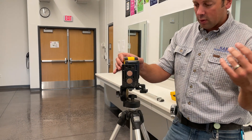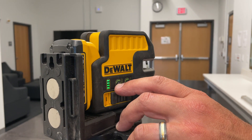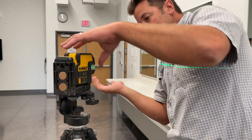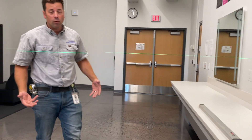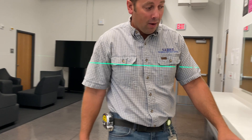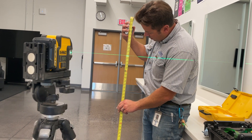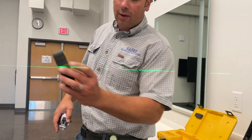At this point, when I'm relatively leveled in, I can turn this on. I've got a full battery. I've got two options: I can throw a constant horizontal line, I can throw a set of dots, or I can do both. We're going to go constant horizontal line — that's going to give me my elevation line. This is just a flat-with-the-world laser line. Because we're indoors, we can get a visible line around the entire room. Outdoors, unfortunately, this is only visible for about 15 to 30 feet depending on if it's a bright sunny day. If you do this at night, it's awesome — you don't need the remote locator; you can just do it with a tape measure. My magic number here is 52 and 5 eighths — I can see it everywhere. But when it's light out in the sunlight, where we're going to be, then you have to use the remote receiver.